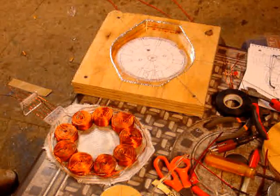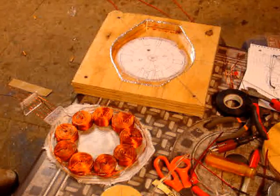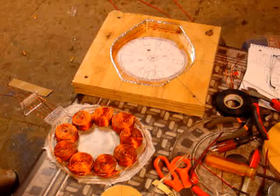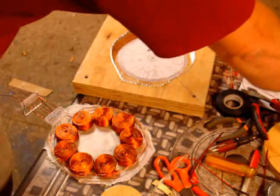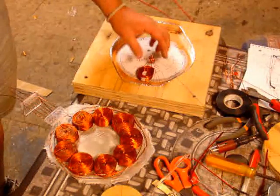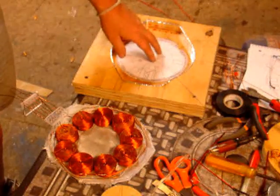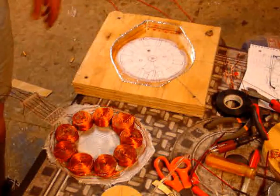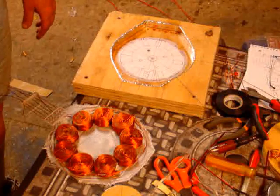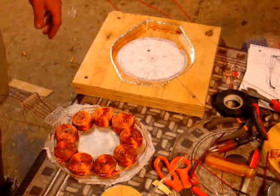I'm trying to do it small and cheap where everybody can afford it — that's my dream. I see too many companies ripping people off. I think I can do this better, and I know these machines are 95% efficient. Let me show you one of the first coils I had — you can see the shaping right there, that's what it was wound for. That was 88 turns, stepping down from the bigger unit. I figured I'd halve everything, but you can't do everything by percentage — I found that out the hard way. These are 300 turns, and that's what it took.